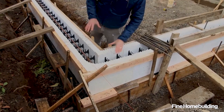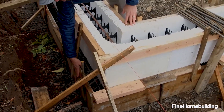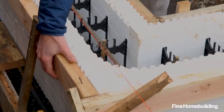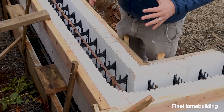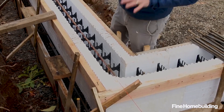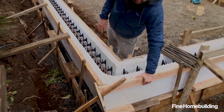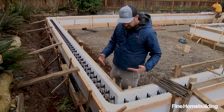Here we have the footing that's basically ready for the concrete pour. It has a six-inch stem wall and a twelve-inch footing. We formed the footing down below with a 2x12, which creates the twelve-inch footing, and on top of that we've set the insulated concrete forms. The wood framing keeps everything in place so the concrete weight doesn't cause the foundation to deflect. Once the concrete is placed and sets, we pull off all the wood support and leave the ICFs in place — the form becomes the insulation for the building itself.